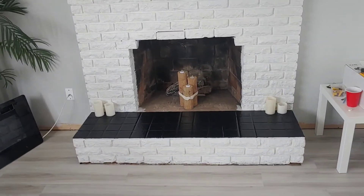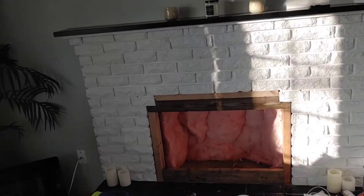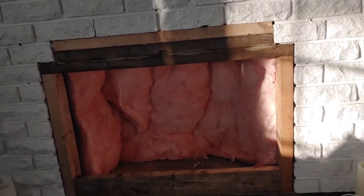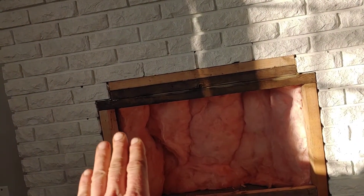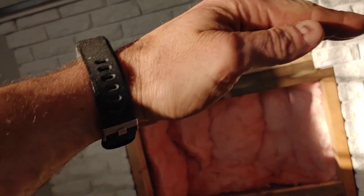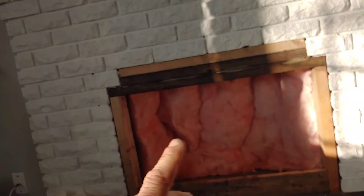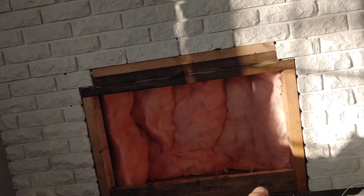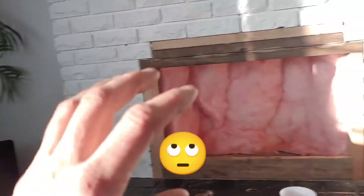It's already looking way better. Continuing with the fireplace overhaul — I've put some fiberglass batt insulation on the inside of the firebox since there can be no heat in here again. We're just going to have the electric insert. I've also plugged the top of the chimney with two batts to cut down drafts, and I've stuffed some material in the steel liner. Now I've built a little frame out of two-by-four so I can insert this electric fireplace insert and make it flush mount.